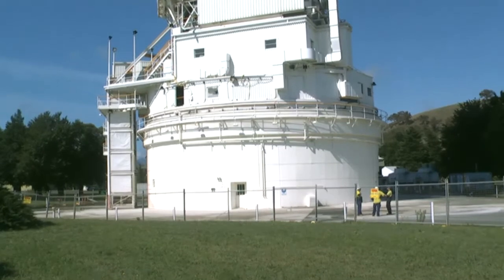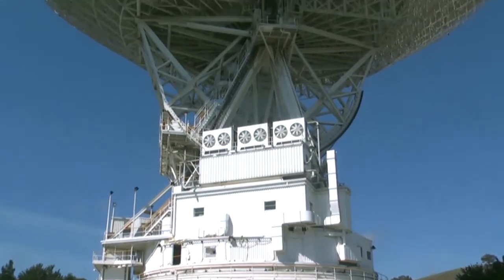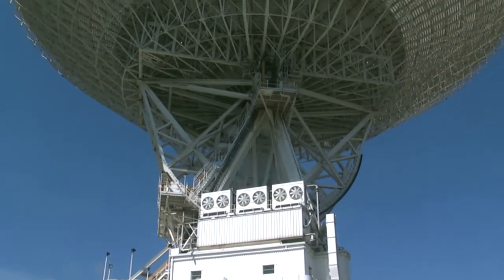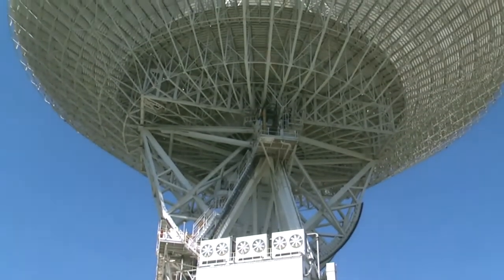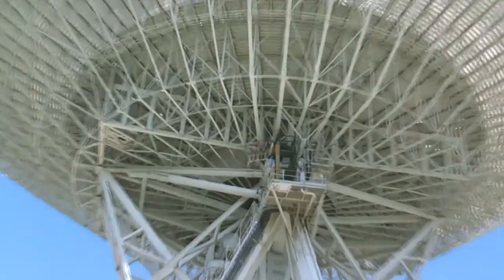My experience at home has been that I've had both C-band and KU-band dishes, and when you get the sort of weather we're getting at the moment, which is very overcast and cloudy, the KU-band would drop out, whereas the C-band would be perfectly fine. We have the same thing. S-band is robust, but bandwidth is limited. You go into the X-band, and we hope to have enough margin so it'll buffer us from the weather. So if it's torrential rain, then there's very little we can do. K-band, you can have a cloud and you'll see degradation.